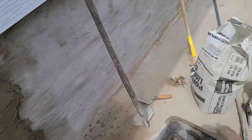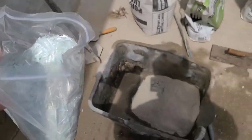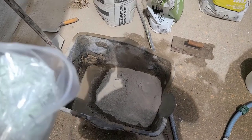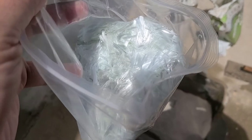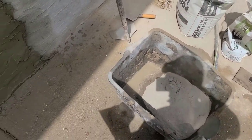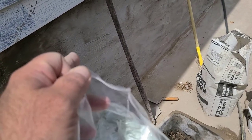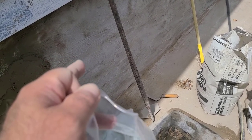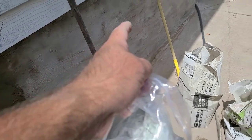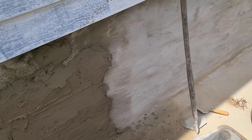One thing I forgot to mention - I've got some fiberglass here. I don't always have this, but I put just a little bit in there. You really don't need much - this is probably enough for the rest of my life. You break it up and it puts little fiberglass strands in there which helps with cracking. This mortar is going to shrink and crack over time - actually within a week or two - and there are some shrinkage cracks in another part I did already, I think because the sun dried it out too fast.